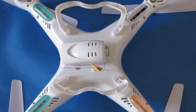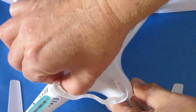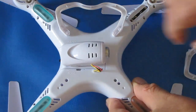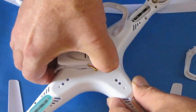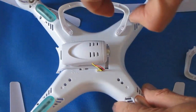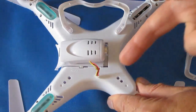To remove the camera it's very simple. First, I recommend pulling the stand from the quadcopter on the side where the camera's power cable is — that gives you better access to the cable. Also push the camera back to open the door just a bit, which gives better access to the power plug. Then, using your fingernails with your thumb and index finger, gently pry the plug from its slot.